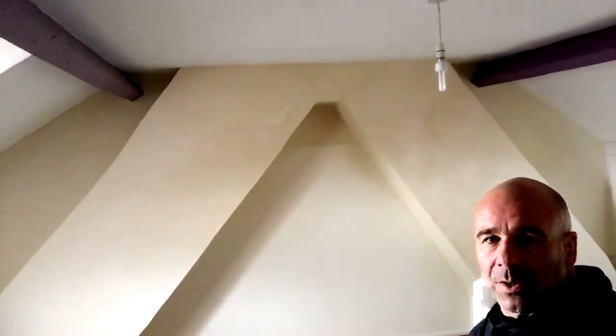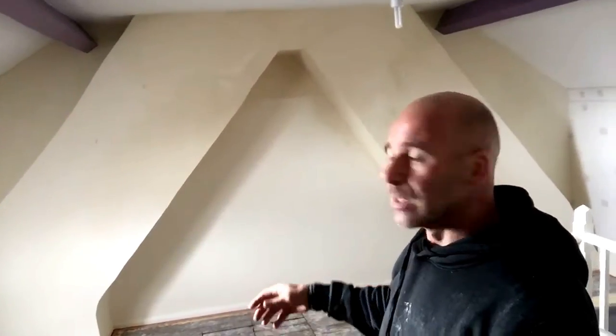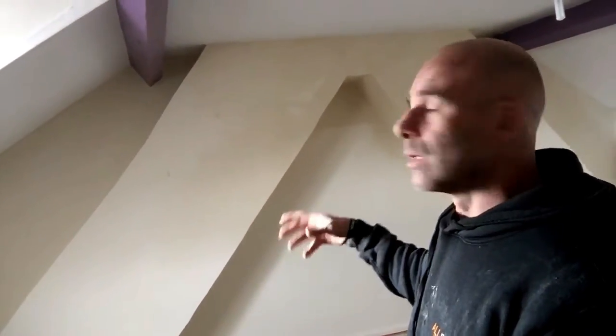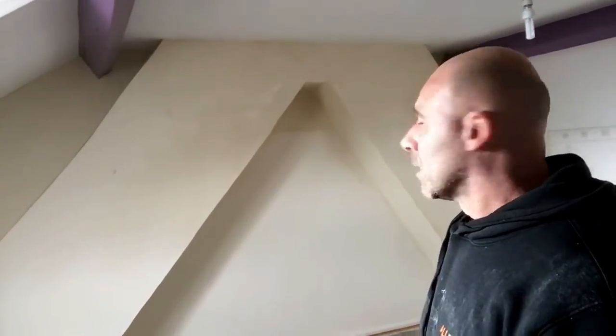And we go up into the attic — which will keep us fit, my knees are going! Look at this chimney — that's as bad as it gets. Basically soot from the chimney flues inside for 110 years, fossil fuels burnt on fires downstairs. Inside of here it'll be lined with soot, which has sulfates in it — it's carbon. When they've got wet because they're not vented, sulfates migrate to the surface. Which is unfortunate.